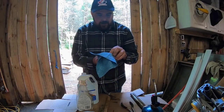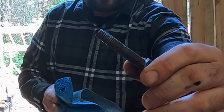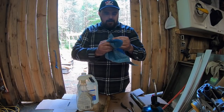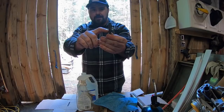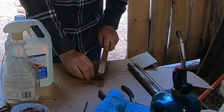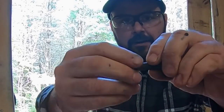Here's a bolt I'm getting out. This bolt was caked with rust, but as we can see, the rust is now loose — whereas before it was solid and I couldn't take that stuff off unless I got down to work with the grinder. All I'm using here is a little shop rag, just going around it once or twice. The hardest part with a rusted bolt is the rust in the threads — but watch how easily I can take that off with just a very light scrub with my steel brush. It just comes right off.